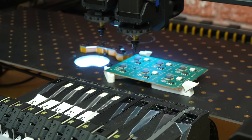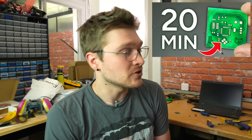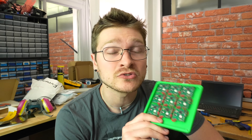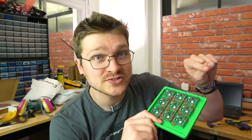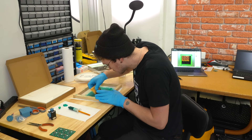These are pretty standard PCB requirements — not like a single SOIC-8 and some 1206s. Also, this board did not need a second side. I ended up using a single 0-ohm jumper to jump one trace over another, which kind of gives you a free second side of copper, just for a tiny bit. It's not going to work for a fair number of designs, but if your thing is not terribly complex and you have enough board space, it works. It's like buying yourself a couple of vias for the cost of one component and one feeder slot — that's a pretty good trade.